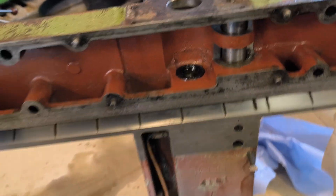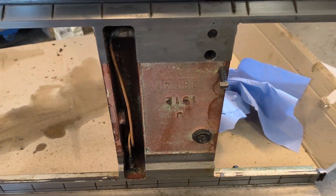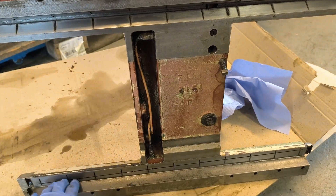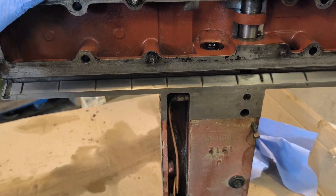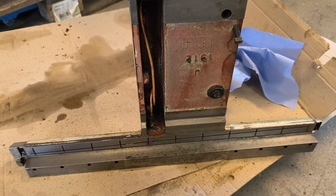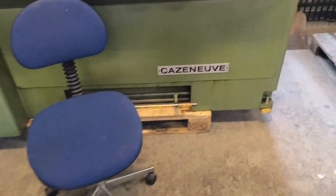It was okay because it was totally clogged up with old swarf and dirt. So now I have cleaned all the oil grooves on both sides. Now I will give it a large clean up, oil it, and put it back on the bed ways. That's the status so far.